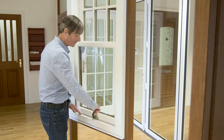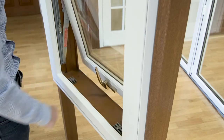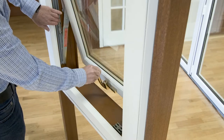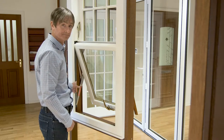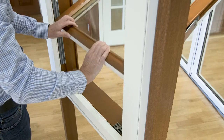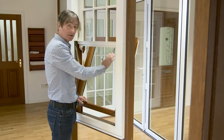If you push the button again, open the handle and it will engage into a restrictor point. To release that, push the button again and it will engage into a second position. Then push the button once more and this will allow the sash to fully reverse, enabling you to be able to clean the window.